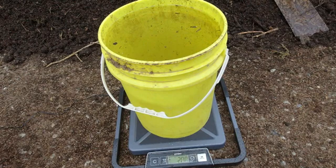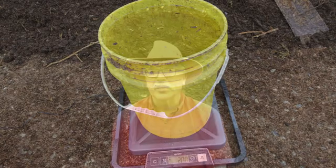The procedure is as follows. First, the bucket needs to be calibrated, which only needs to be done once. 20 litre buckets are not always 20 litres. With the bucket zeroed on the scale, add 20 kilograms of water. Mark this water level in the bucket. This calibration method assumes that 1 kilogram of water is equal to 1 litre, which is close enough in most areas.